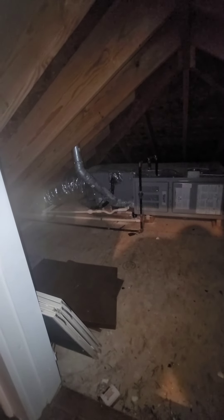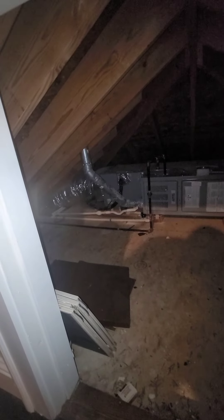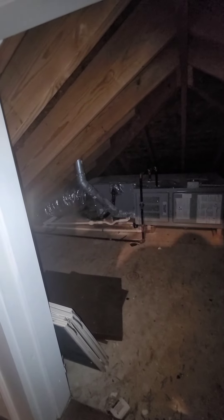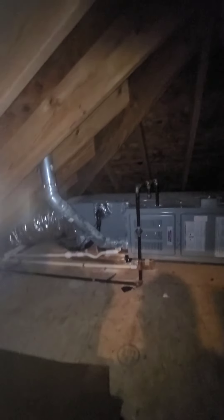This old furnace is working, but the air conditioner — we've propped it up a few times and it's working now, but I'm nervous it's going to go out. We've got a three-inch vent pipe on that, which is illegal. It came off four and they downsized it. Whoever put that unit in needs their license revoked. They should have never done that.